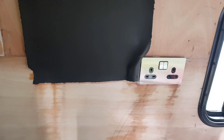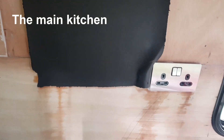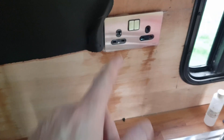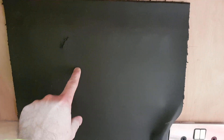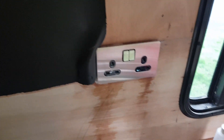There's another leak here - don't worry, there's no 240 volt wiring on the ring circuit at the moment. Behind here is a vent to outside, and we think one reason the water's getting in is there's no lip across the top of it to divert rain away. So the rain is just coming straight through the vent. It's a replacement vent we had to put on, so we need to fix that as well.